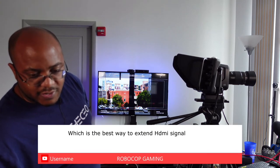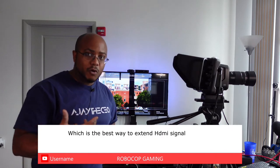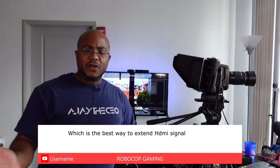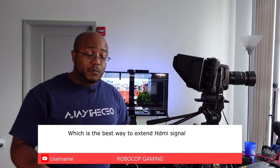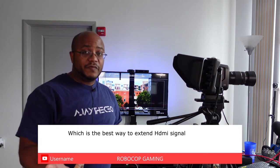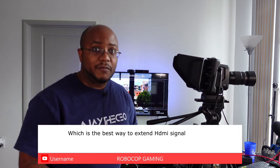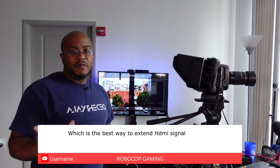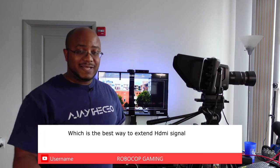Which is the best way to extend HDMI signal? Honestly, I like SDI. That's what I normally use. SDI can go 300 feet. I mean, you could go to fiber if you really wanted to. That's expensive. That's like $150 per adapter converter. And then fiber optic cable, you can go 29 miles. For me, in most of my installs, I usually use SDI.